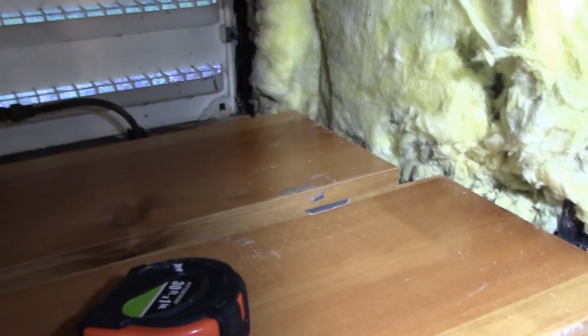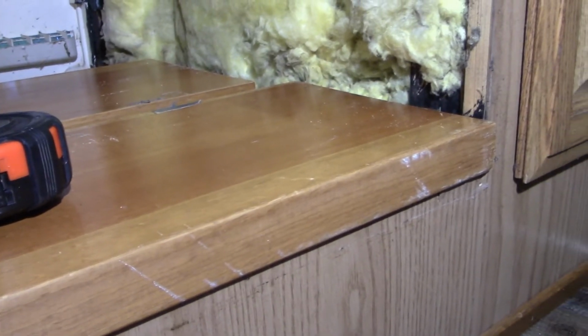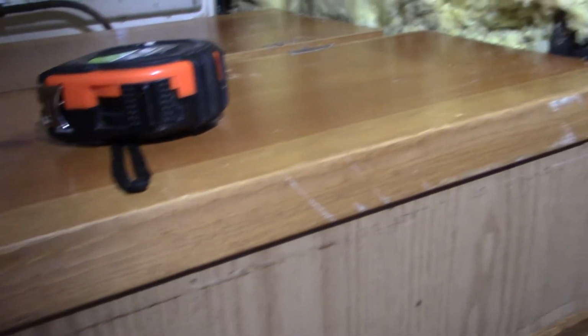This is 1 1/2 thick. It's 2 by something. These are 2 by 10s, 2 by 8s, 2 by 10s. I'm going to put 2 of them in there, supporting the front and then the back, and I'm going to screw that down. Sorry, I'm trying to help you with light, but it's not happening. I actually have it overhanging just a little bit over the front edge. That will allow me to caulk underneath it, and that'll be completely invisible, and I think that'll be a nice finish.